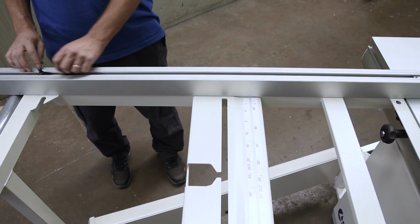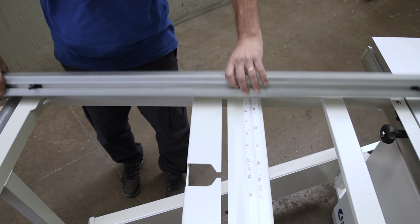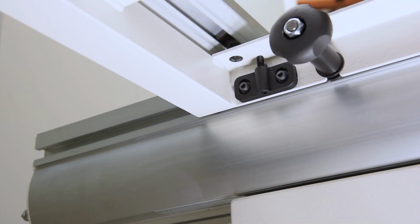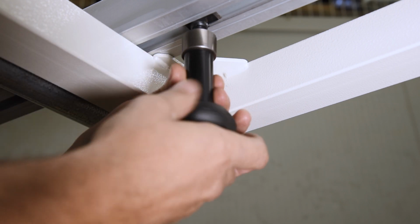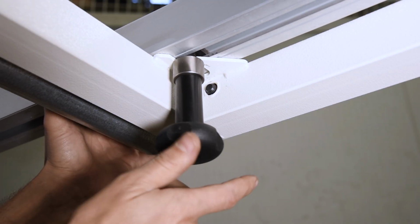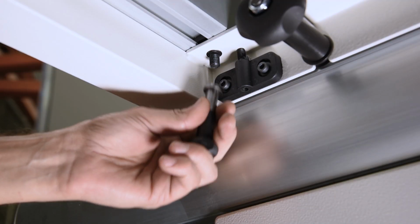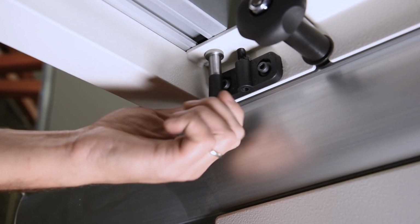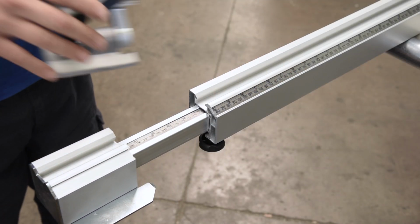You can now install your squaring fence by dropping the pins into their spots. The pin on the far end goes into a slot which allows for fine-tuning the square adjustment. The steel face of the knob rests against an adjustment bolt so the fence can return to square every time it is moved and returned to 0. Then install your flip stops and you are good to go.